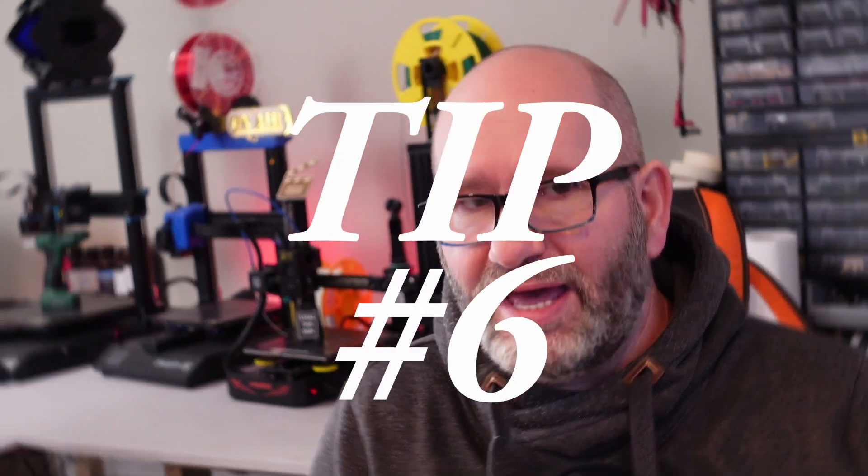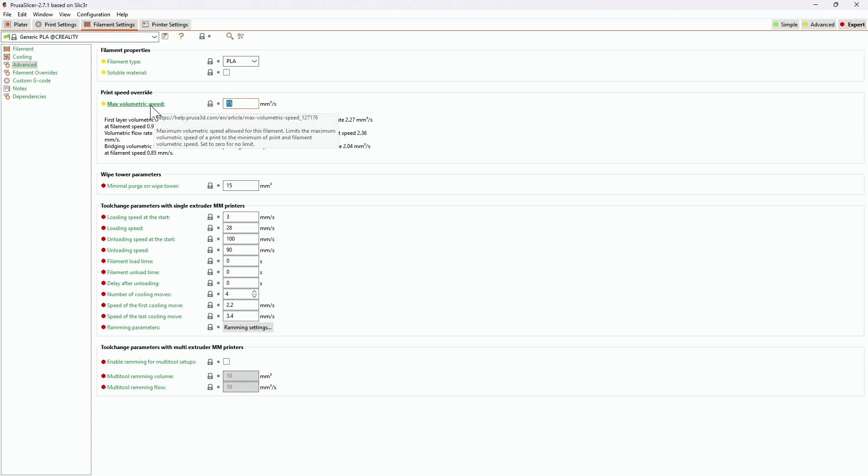The fifth tip: since I've already talked about the slicer a lot, getting the latest and greatest slicer is really going to improve your print speeds, because newer settings have developed over time. The slicers I'm currently using are Orca Slicer, Cura, and Prusa Slicer — and I think they're the best you can get. Some older printers with new firmware and the latest slicer also support volumetric extrusion. If this is a setting you can choose, do it, because it allows for more accurate control of filament flow and therefore faster prints.